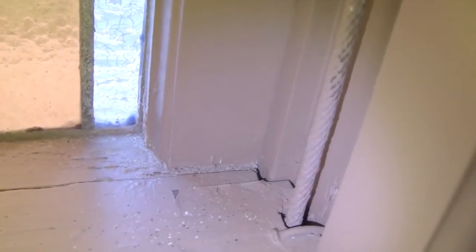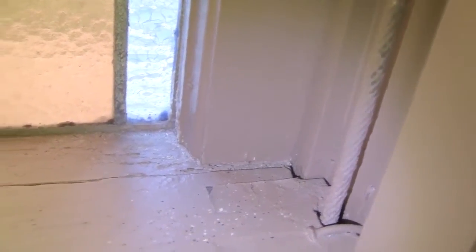And then, of course, also the fact that when they redecorate and paint, they probably painted that crack, that connection, and that will also have to be scored with the utility knife to break that seal in order to get this lower half of the double hung out.